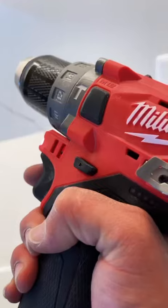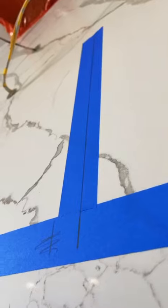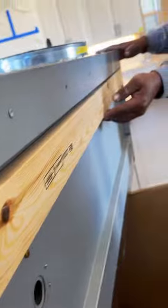99% of the time there should be a stud behind there, so just measure 16 inches from the screw and by doing that you'll know exactly where your studs are. I also recommend you get a hammer drill, but before you start drilling you've got to make sure your measurements are right. This hood is going to be 35 inches away from the stove top — depending on the hood you have it's different, so just check your instructions.